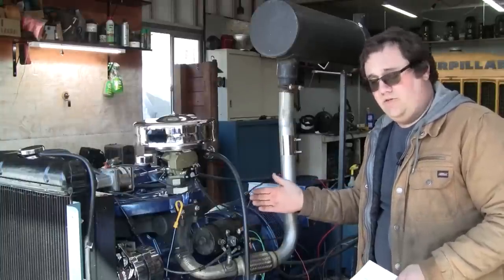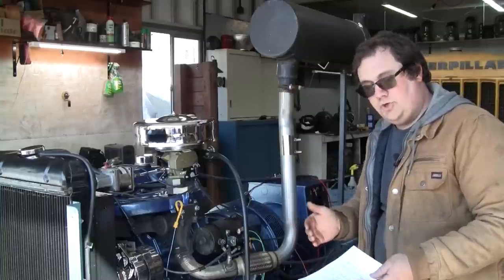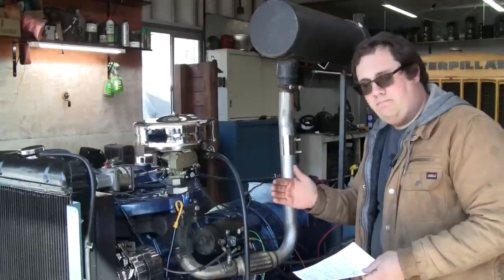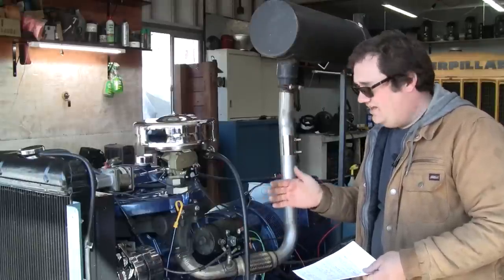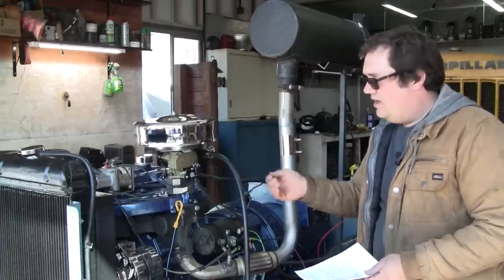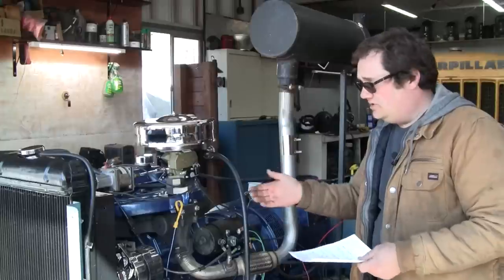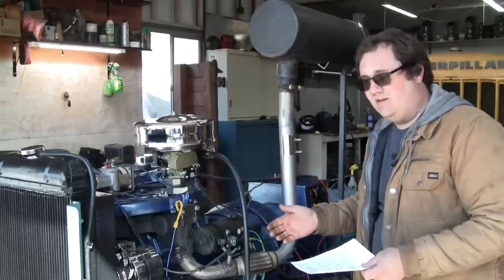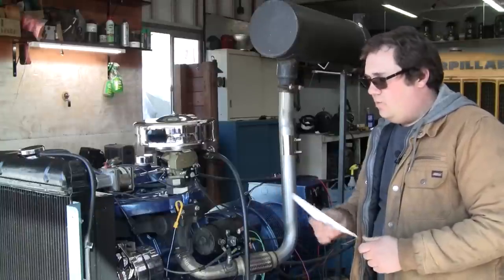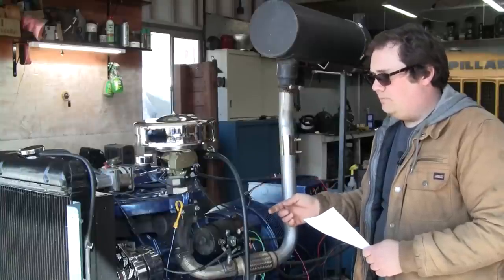That's it. So once you get the advance, obviously you have to have the timing retarded to assist in starting. But once you hit 1800 RPM, that's where your timing's at. Now, it may be slightly beneficial to increase the timing as the load increases, but again, you're not increasing the speed. Increasing the load does not increase the engine speed. So the timing doesn't really need to increase that far. We can play around with that a little bit later, maybe in this video, maybe in the next video.